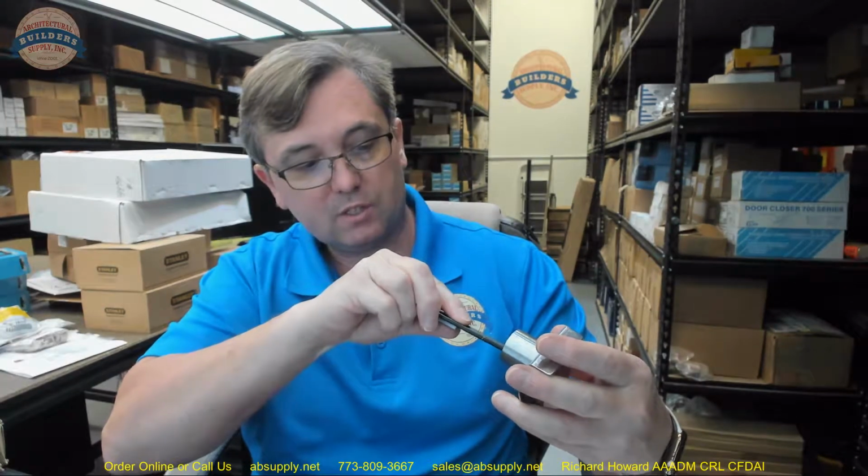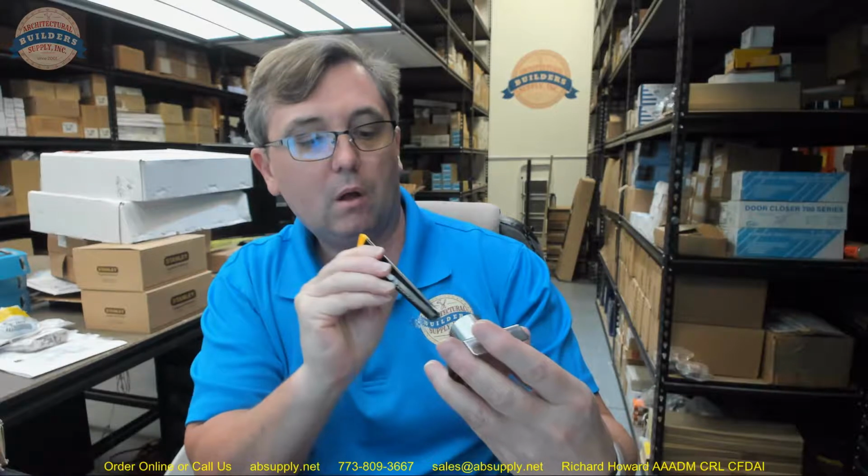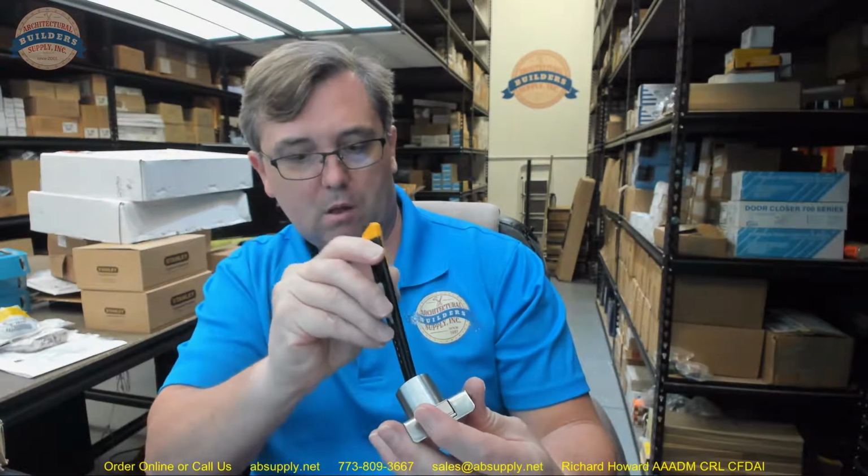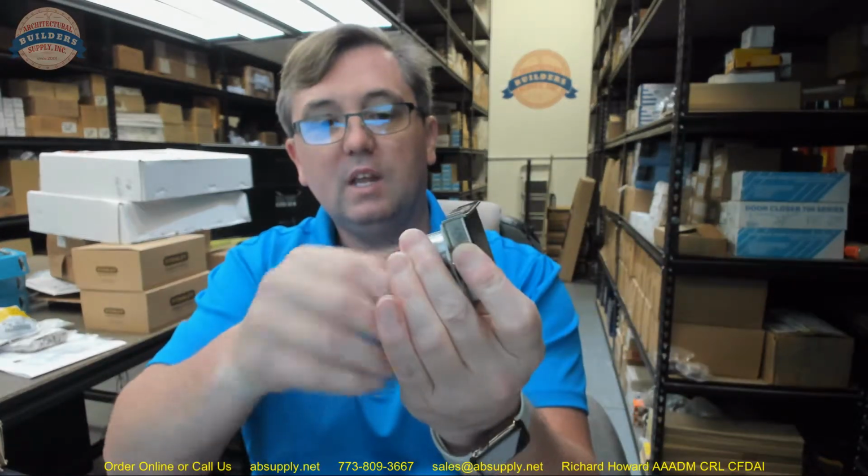The deadbolt has a 3/4 inch throw, and I will get a small format core and see if we can manipulate that. Okay, so I've come up with a core. The tailpiece just isn't, the driver just isn't exactly vertical. Sorry. Okay, got it pretty close now. Okay, got a core inserted into it. 360-degree rotation. You can remove the key in either instance. Okay, let's test the projection. That's what we're looking for.